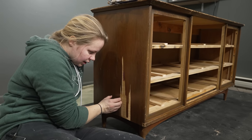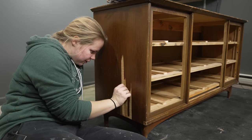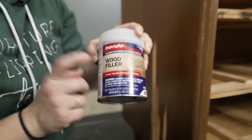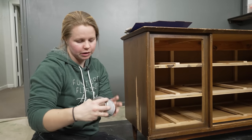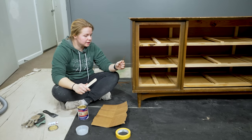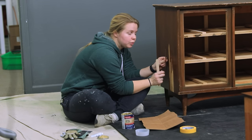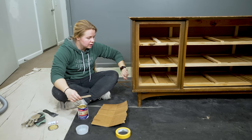This really isn't too big of an area, and it's going to be able to be filled in with Bondo, which is a wood filler. This is actually the first time I'm going to be using this type — the wood filler version — before I've just used the actual car Bondo. The reason I decided to peel it off instead of leaving it is that if you applied Bondo over peeling veneer, it would still peel up. Bondo isn't sticky — it just fills in the dent where the veneer is missing.